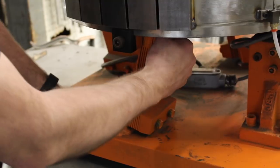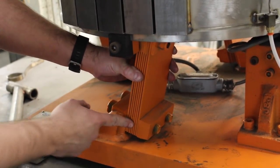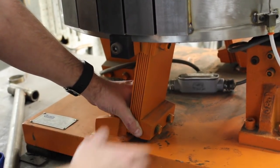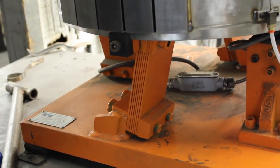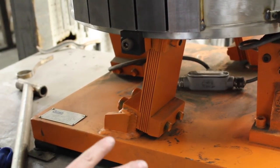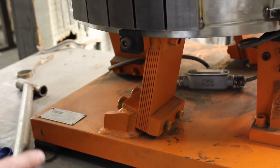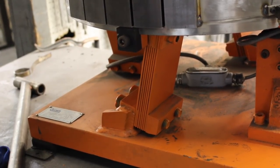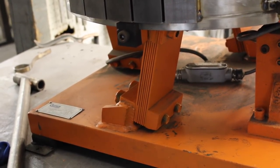What I'm going to do is show you each one of these — when you take all these off you'll take the springs or spacers in between. If you had to add a spring to speed it up, you'd slap one more on, tighten it all back down, and get on that with a cheater bar — these have to be super tight for the units to run. If anything is loose it's going to give you a false reading. Basically this unit is right where it needs to be: just under tuned with good speed.